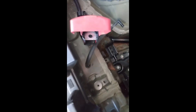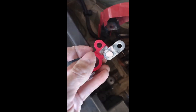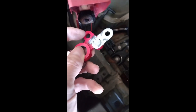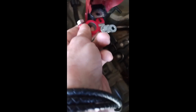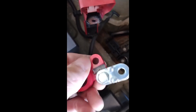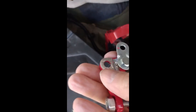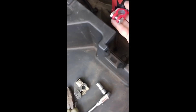What we are going to do is directly put one of the screws of the new connector into that hole. But for this to work, we need to remove the paint here because this will be in contact with the washer — we need good electrical contact. So just with a cutter, remove the paint. Here it is with the paint removed.